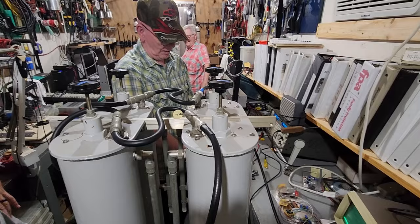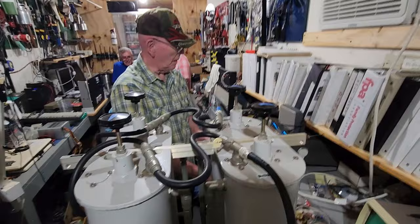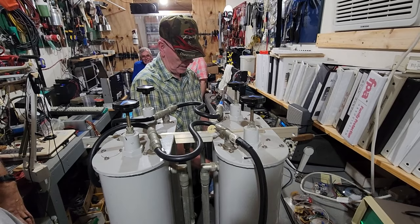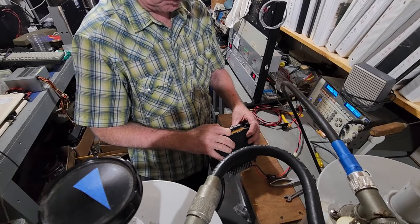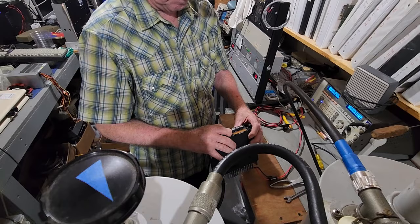Now we're going to change the frequency on the radio, Don, to 146.880. So now we're on the 880, and what we want to do is come up with — we're on the 8.8, so that should be 2.8 on the other side. We want 8.8 over here and we'll put 2.8 up here. We just flip these two. The radio's on 8.8 and the service monitor will be on 2.8. We're going to try to override the 2.8 signal into the 8.8 side and look and see if these guys are rejecting like they're supposed to.